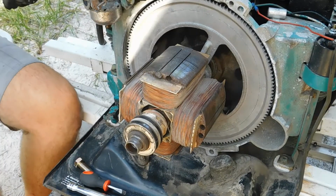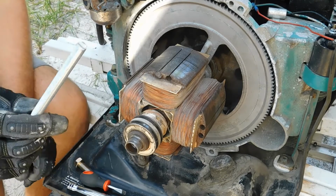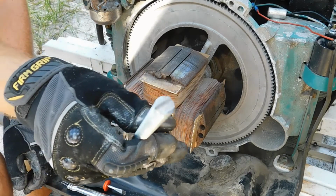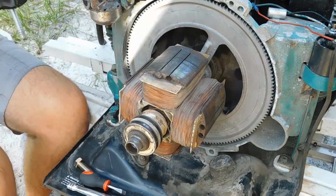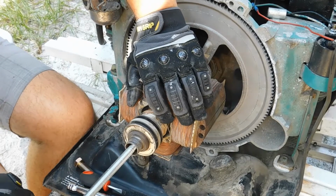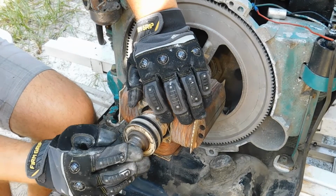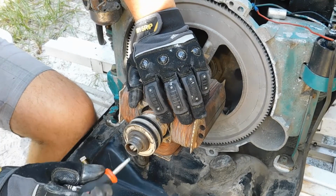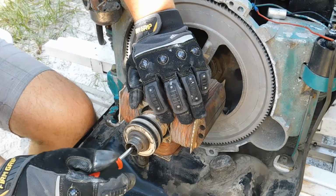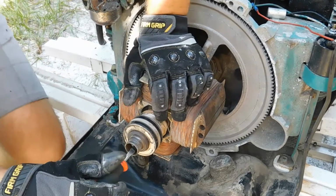Hello everyone, now we're back. I have shortened it a little bit by about a 1/4 inch to a 1/2 inch, and I put a new notch in it as centered as I could get it. So now we're going to try this again. Let's go ahead and put it in. Goes in a lot further this time, which is good. We need it to seat past those primary threads in the front that the 9/16 cap screw screws onto.